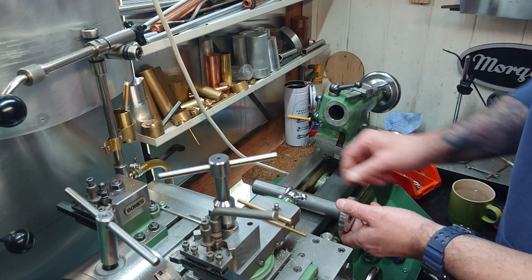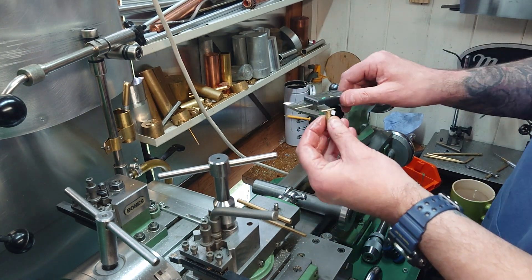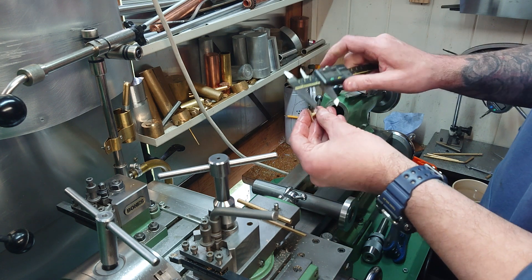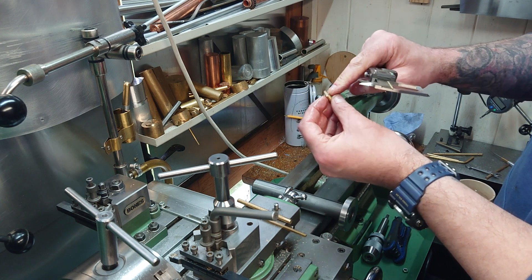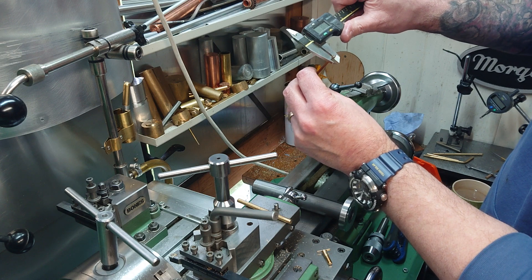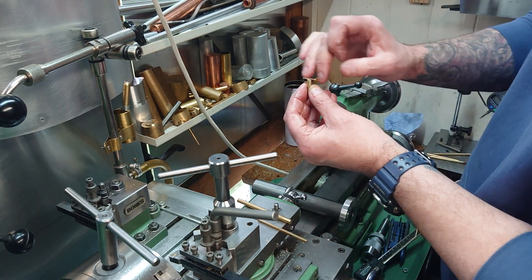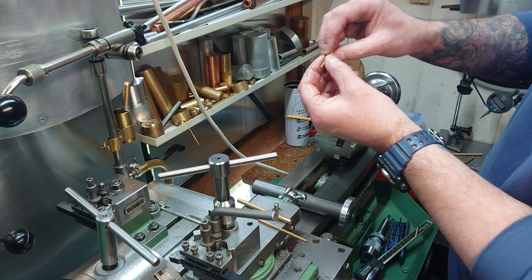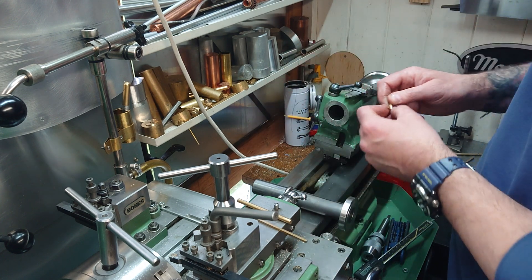So what I've done is I've made up a brass section - 6.3mm diameter - and on that I've put an M6 thread, and it's roughly 25.5mm. In the top of the brass I've milled a small slot for the square section of brass to fit through, and that's 3mm square. I've set that in there and silver soldered it, then dressed it down on my linisher. There's a bit of hit and miss just trying to get it just right, and remilled these slots slightly. But now I've got a system where I can put that back in, screw that tight, so there's no play in this and no play here - it eliminates the slop.